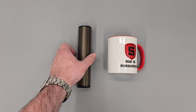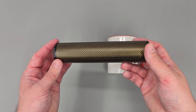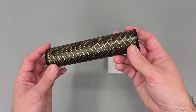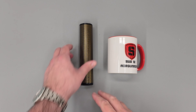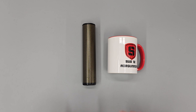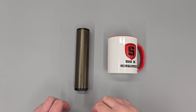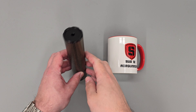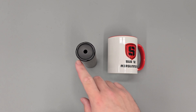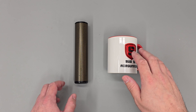I did see a few people mentioning that they would like to see the aluminium left raw rather than anodised black. That is an opinion I do respect; however, when the moderator gets screwed onto the rifle the parts always look better in black as they just match the rest of the rifle. And if you really wanted to, you could strip the anodising by inserting the aluminium components into a caustic soda bath, which would strip the anodising off.